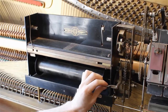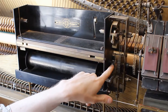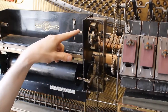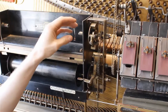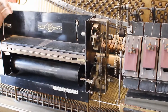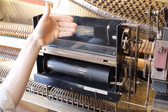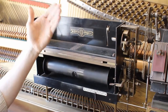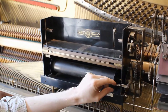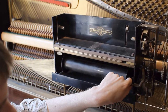When you're done, you flip the rewind switch up — you hit rewind — and that disconnects the main cam from the lower gear and actually engages the raised spindle, which allows it to spin in reverse so you can rewind. If you're not careful with the player and you don't rewind it, what will happen is when you get to the end and you're not paying attention, it can actually continue to just roll the paper right off the roll. So you want to be aware of when you play and rewind — you can see that on the roll itself. Press rewind, and that again disconnects. Play, rewind.